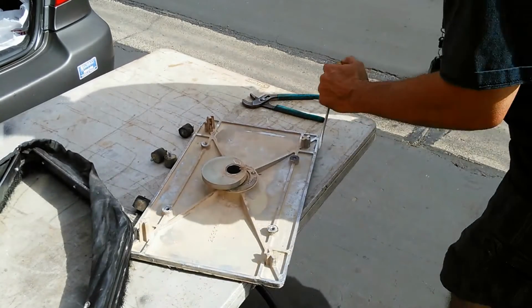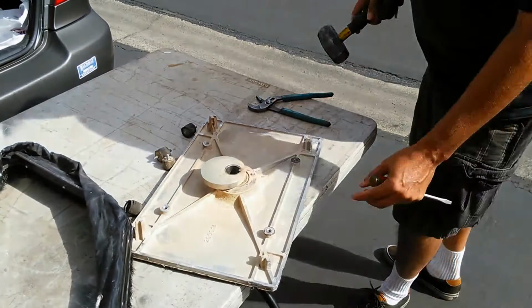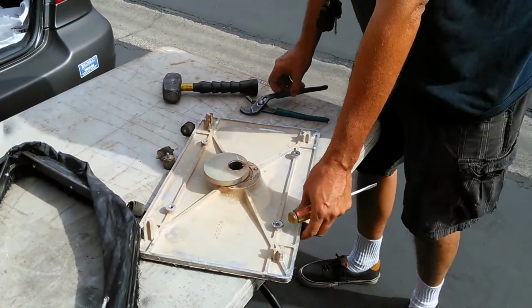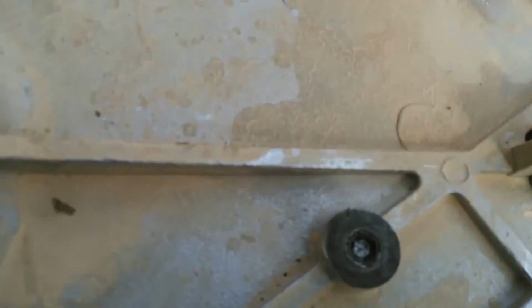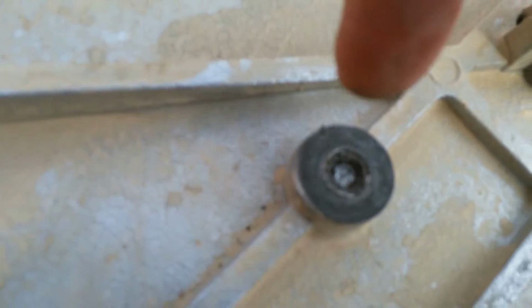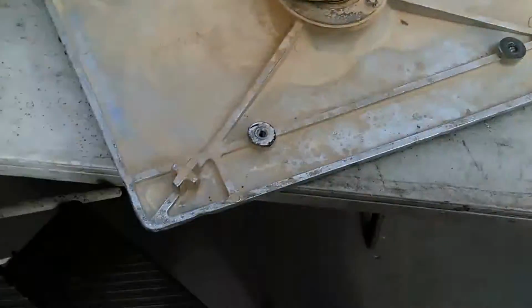So I'm thinking whoever put this in here, they might have actually double threaded it, which means I'm going to have to end up retapping that hole anyway. The other method that you can do with this guy here, and I'll kind of show you, there's the hole right there, stud's right in the middle. Okay, so the object is to catch it with the edge of this, if you can, if there's an edge in here somewhere where you can grab on, and then just kind of knock it around clockwise, or I'm sorry, counterclockwise to where it twists out. But that's just not working today.